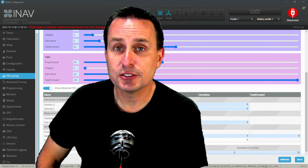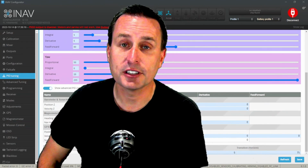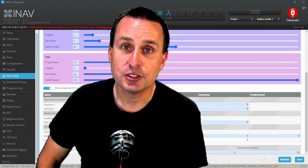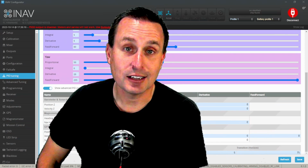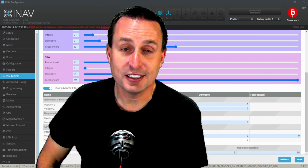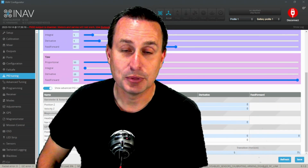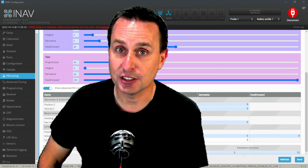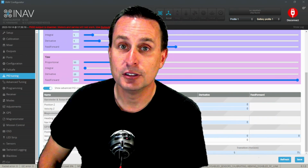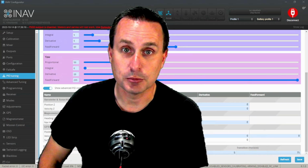Now, this generally leads to another observation I've seen when working to tune altitude control. iNAV really could use, well, honestly, I wish multicopter worked the same way as fixed wing, where you didn't have a Z velocity PID loop. You just had a Z position with a P, an I, and a D term. That's all you really need. That's how the fixed wing works, and it works fine.